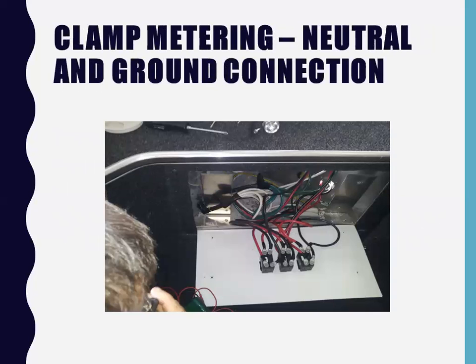This was a boat that took me forever to figure out. Those white wires with tape on them, literally they didn't tape the top of the bolt. The bolt was touching the frame of the houseboat. It took me 3 days to find this neutral ground problem.